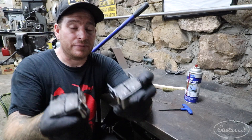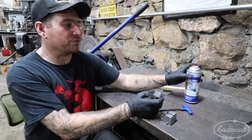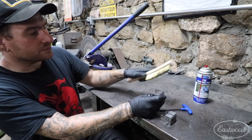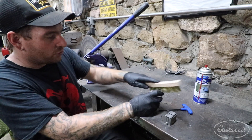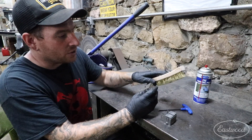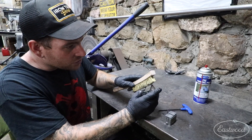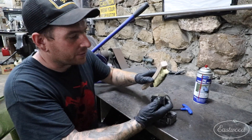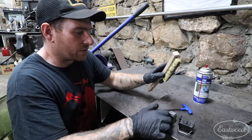One of the things I like to do is pull these jaws out periodically and get them on the bench. First, spray it down with a little bit of PRE, then take a wire brush and just work it over the jaws lightly. I have a brass bristle brush here, but you can use any — I prefer brass because it's a little more gentle. With just a little bit of sweat equity we'll have something that's pretty darn clean.